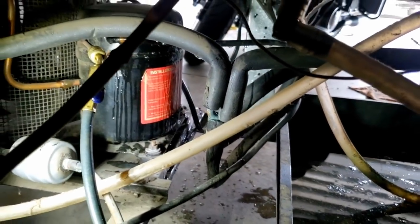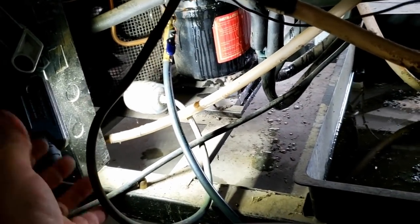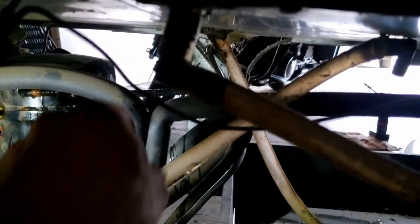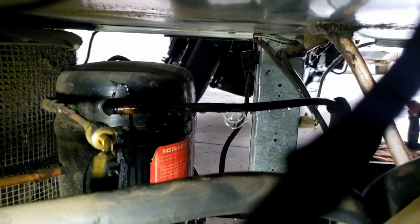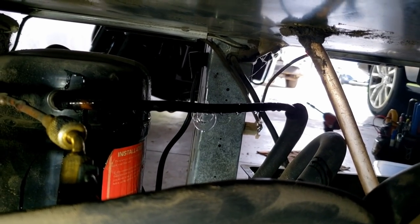Right there — we'll mark that and repair it. It's right in the middle where they've got drain lines, cap tubes, and liquid line sticking out the back that can get smashed into a wall and broken. A lot of crap in the way. We'll bend some of this out of the way, mark it with the knife so we have a scratch mark to reference, then skim coat that thing and we'll be good to go.